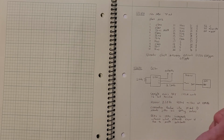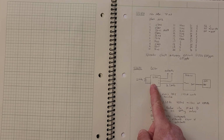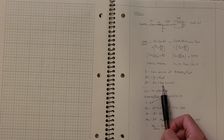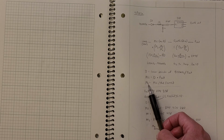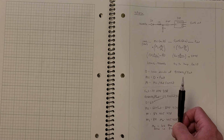And so if you want to make 10 megahertz exactly, you can find multiplier and divider values that will work for this. Unfortunately, in the actual operation of the chip, if you put in weird values for the fractional part, you'll get some jitter effects, which I'll show you. In my calculations, my multiplicative factor is based upon what the reference is, but they've measured what the reference is, so when they do their calculation, instead of 10 megahertz, they calculate using 10.000-something, 15 hertz, and so you get a weird fractional value for M, and you may not be able to represent that in the 20 bits in the math. So the value that they actually get, you might not be able to set it exactly, and it's going to have those artifacts.